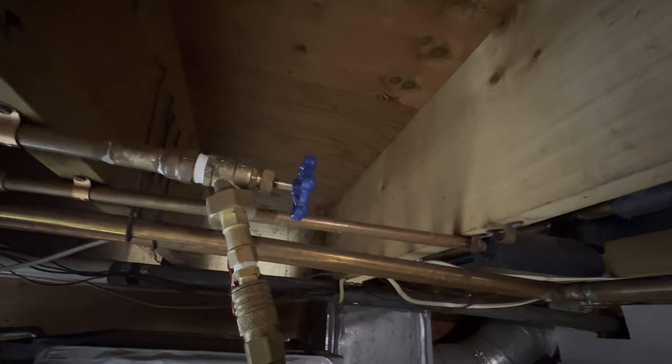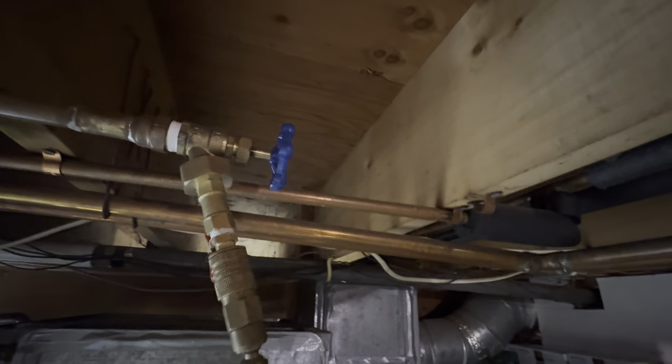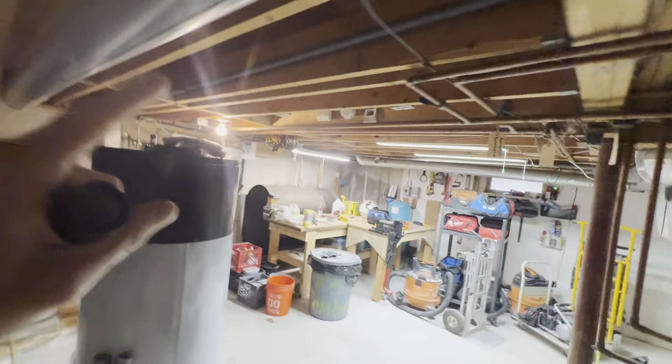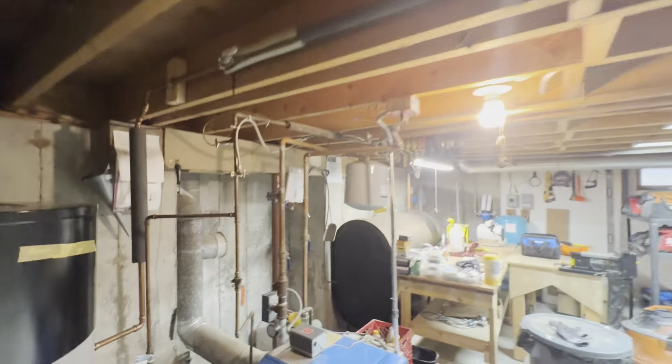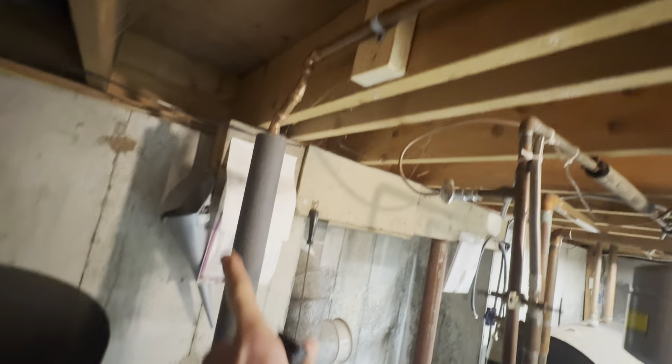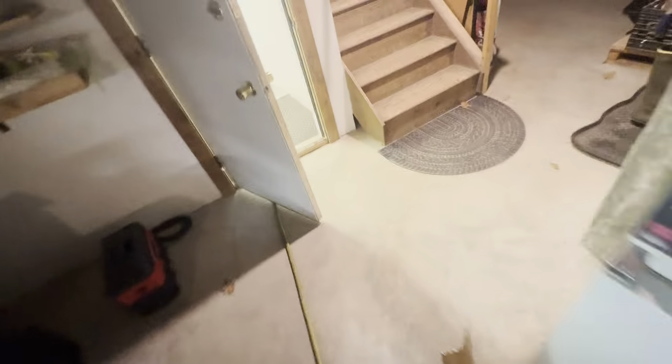You can hear that compressor kick on — it's a small compressor so it probably won't hold 15 PSI, but it keeps pumping air in. It's pushing air through this line up here into my system, back-feeding through the hot water outlet — going in through the out — and that's pressurizing it. Let me show you how fast it's draining right now.